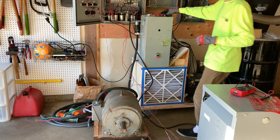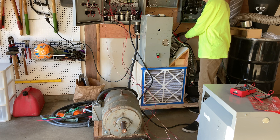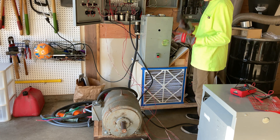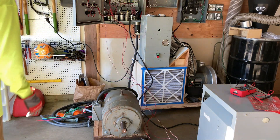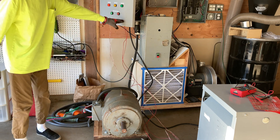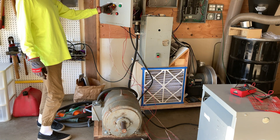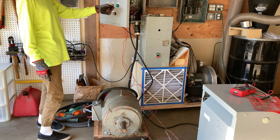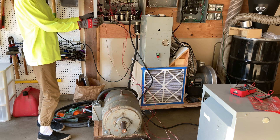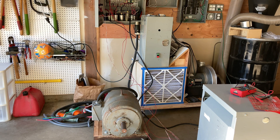Let's start this thing up. First I'm going to hook up this current meter set to max, on the power coming in — set to hold the highest current — so we can see the inrush current for starting this motor. I bet it's going to be a lot of amps just for a split second. What's going to happen: the red light is on now while it's stopped; when starting and the start capacitors are connected, the yellow light will be on for just a split second; then the green light will be on once the start capacitors are disconnected. Here we go.